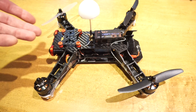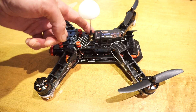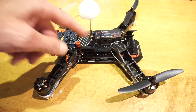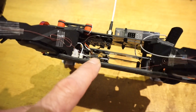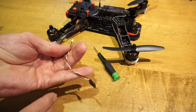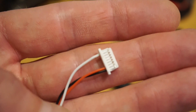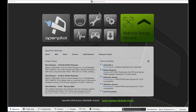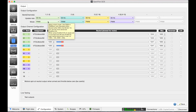Using the CC3D I tried One Shot and it didn't work, but PWM Sync does seem to work. To do that you have to be using PPM, meaning your receiver has only one cable out to the flight controller. You need to change the arrangement on your plug into the CC3D — the signal line which used to be right beside the power lines now has to move over to the 8th plug. Then plug in your Mini-B USB cable, open Ground Control Station, go to Configuration, the Hardware section, your receiver port, change it to PPM Pin 8 Plus One Shot, and hit save. Then go to the Output section, change the first two banks to PWM Sync, hit save, and you're good to go.